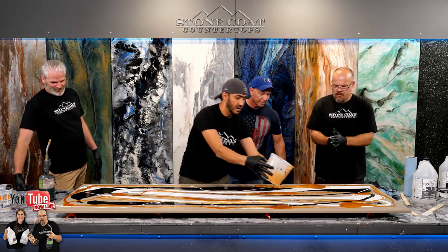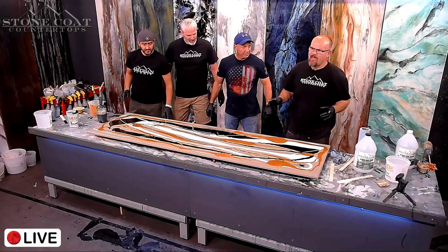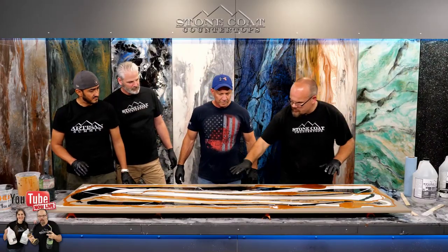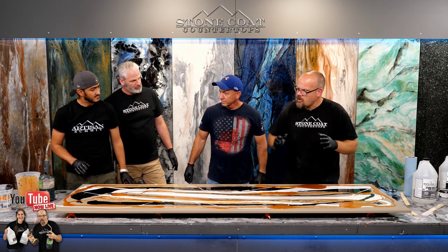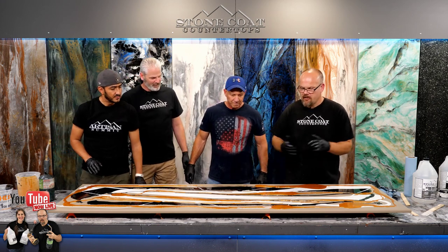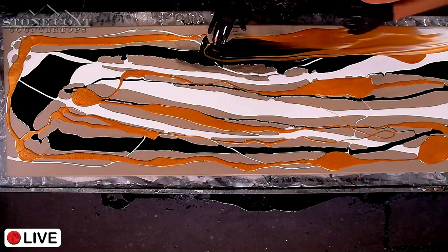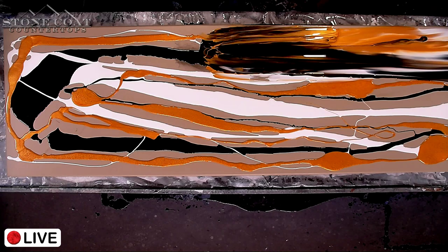Cool. All right, here's what I'm going to do. I'm going to do this half, and you guys are going to work on that half. But watch how fast this is. This is a really easy technique, but all I'm going to do is long strokes. I'm not going to do horseshoes. I'm not going to start and stop in the same place. And I'm not going to overmix it. I want to undermix it, because I could always come back and mix it more. And go slow. We're not in a hurry. We don't need to be fast and throw epoxy everywhere. I'm just going to go nice and easy. I'm just going to push this epoxy around. See how that's balled? I'll bring some epoxy back. I'm just going to push it like this.